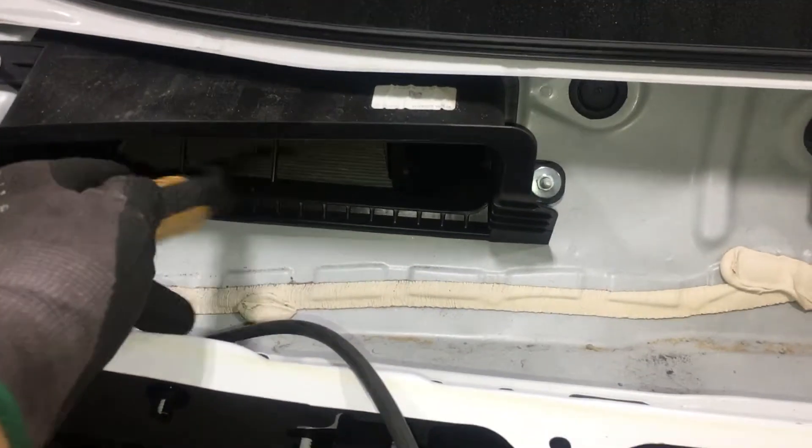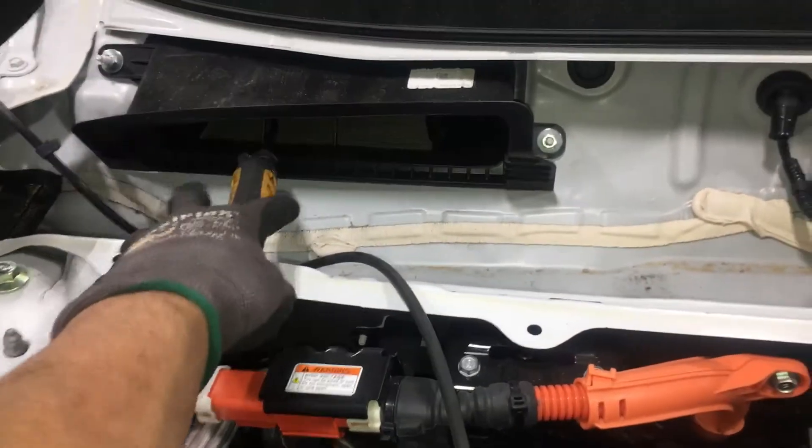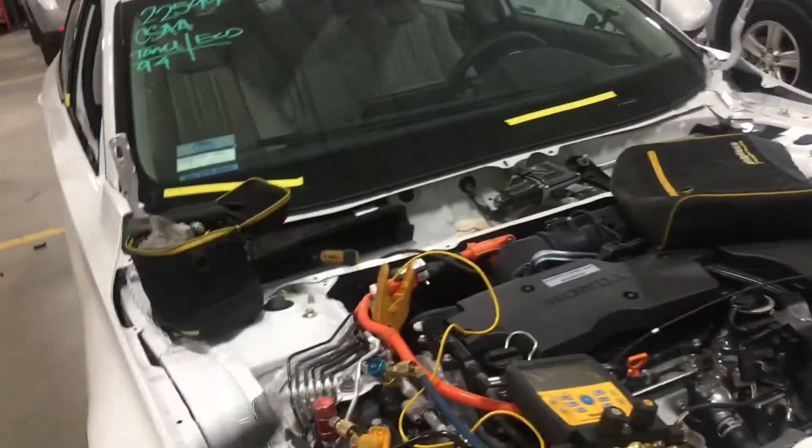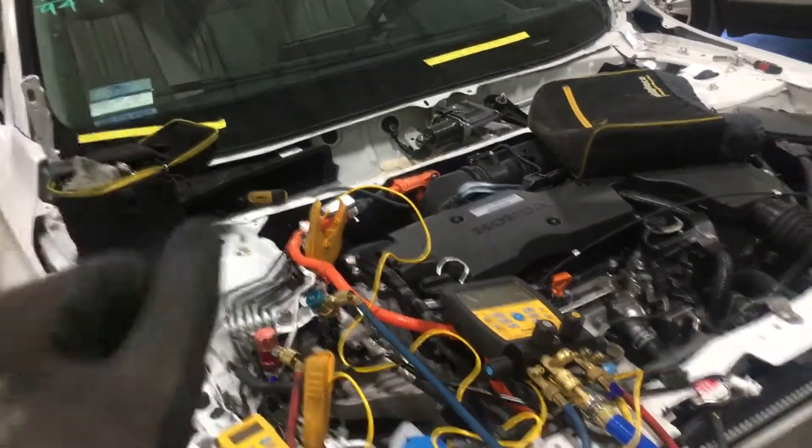I have my port right on top of the filter — you can see the filter in here. I'm actually touching above the evaporator where the filter inlet is to take my temperature measurement of the air going in and air going out, to get your delta T across your evaporator.